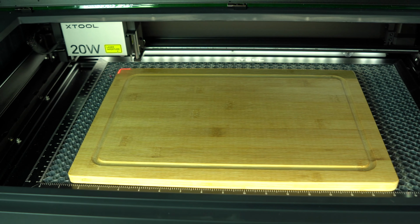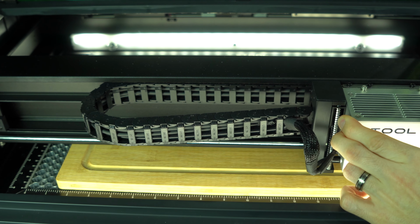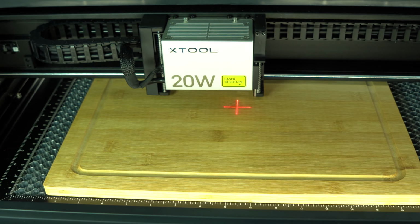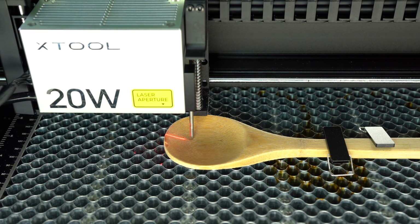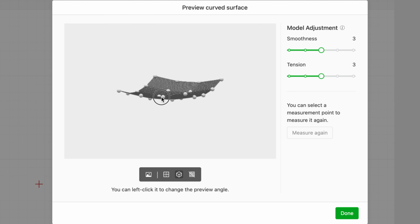and more consistent. Notice that during the marking procedure, we manually move the tool by hand without needing to rehome the axes afterwards. This is because, in contrast to your average 3D printer, or laser cutter for that matter, the S1 has closed-loop steppers. It has a few other party tricks too. Using the touch probe, it can generate a mesh of points on the surface, enabling curved surface engraving using dynamic autofocus. Does this look familiar to anyone?